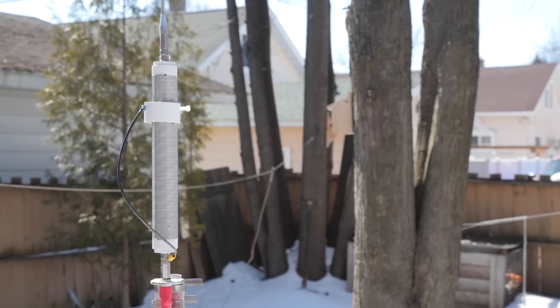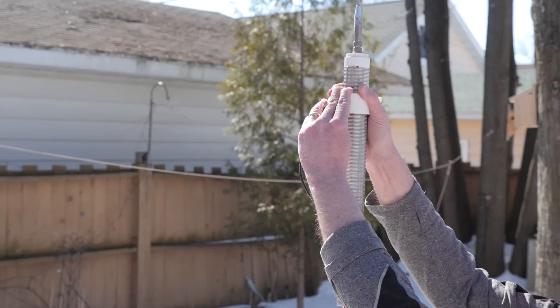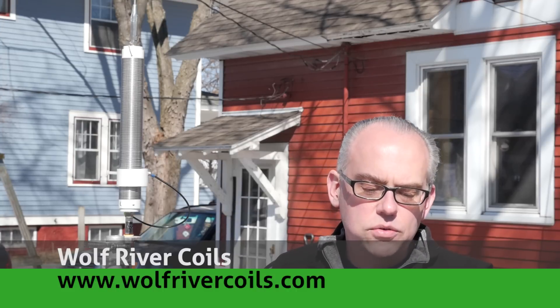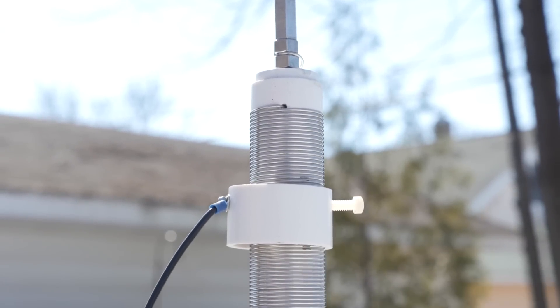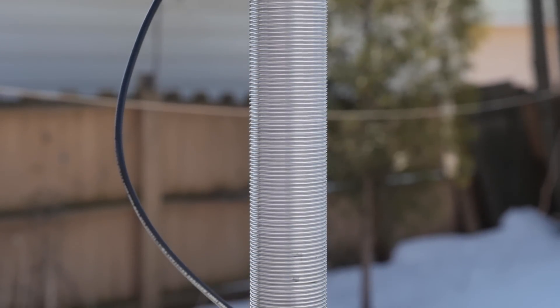Today I'm going to take a look at the Wolf River Coil Silver Bullet line of base-loaded antennas. The Silver Bullet 1000 next to me and the Silver Bullet Mini are a variation of the popular screwdriver-style antenna. But instead of using a motorized slider, these antennas use a manually-adjusted tuning coupler that you slide up and down the coil. According to the Wolf River website, what makes these coils different is their use of a grooved coil for proper spacing and placement of the high-quality stainless steel wire. The tuning coupler uses a heavy-gauge stainless steel pickup clip, and you can feel that quality as you move the slider up and down the coil.